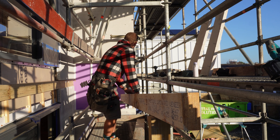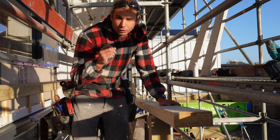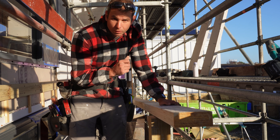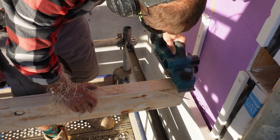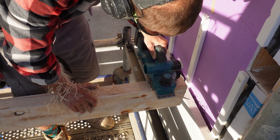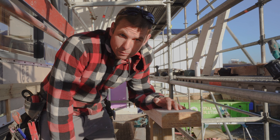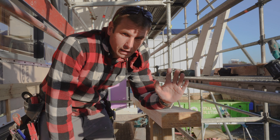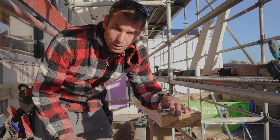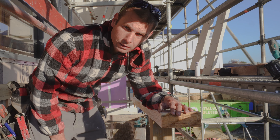So it's 150 but it's actually 152 and a half or so. The beam pocket's 150 so I'll just plane it a little bit. With beams like this you always want to check your camber — any bows need to be going up, unless there's a cantilever, in which case you have it down because the load's on the cantilever which will be sticking up.